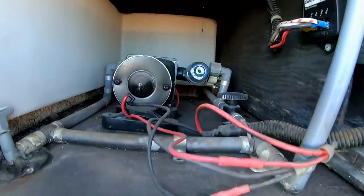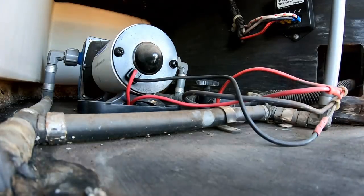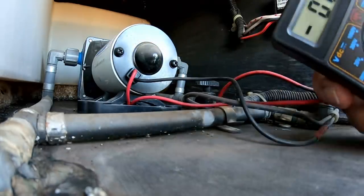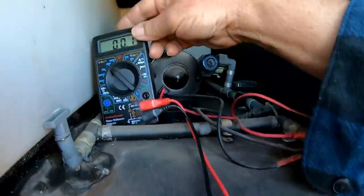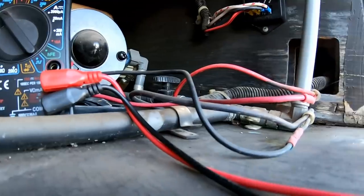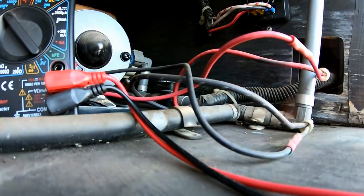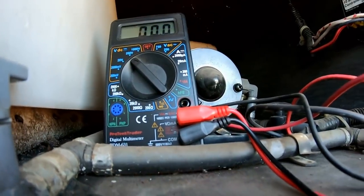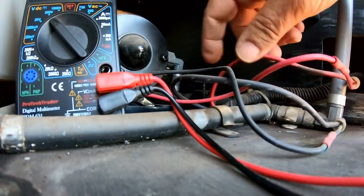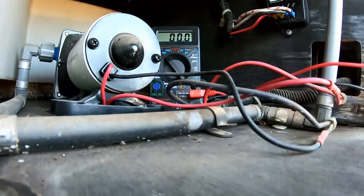What I wanted to check here real quick — I need a tripod right about here. It's reading zero. There's a red wire and a black wire — positive and negative or ground — and I should be able to take the leads off my tester, red to red, black to black, and I should get 12 volts. The switch is on, unless there's a broken wire somewhere.